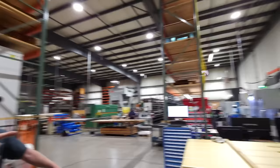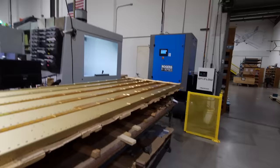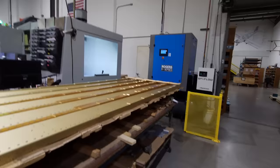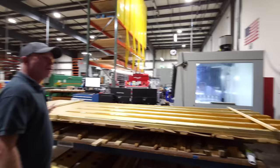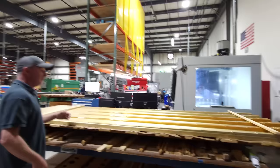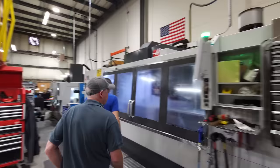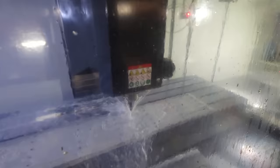This is our CNC area. We have a couple of mills and a CNC lathe. Here we make spar bars. This is the spar — you can see a spar bar riveted to it. The spar bar is a strength thing. You can see where it attaches to the fuselage as the wing is loaded up. This is inside the wing spar. It attaches to the fuselage and would be turned 90 degrees facing you when installed.